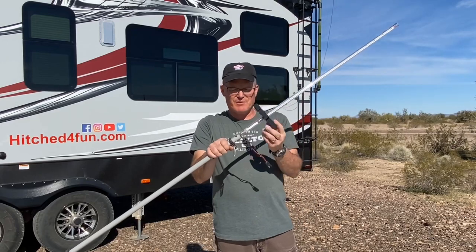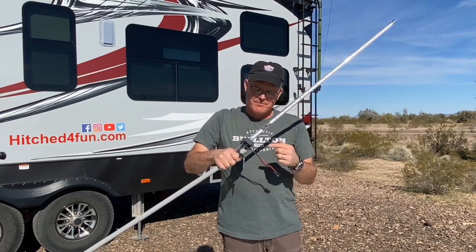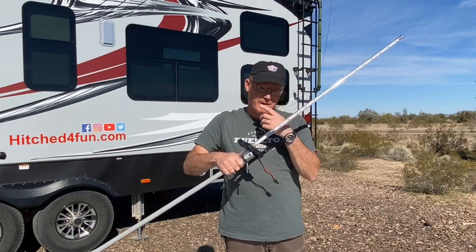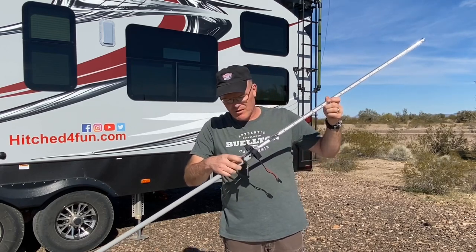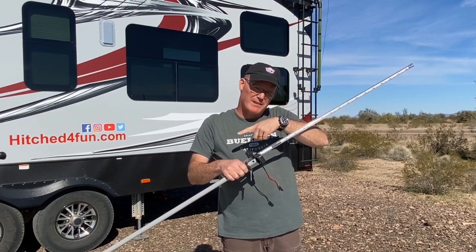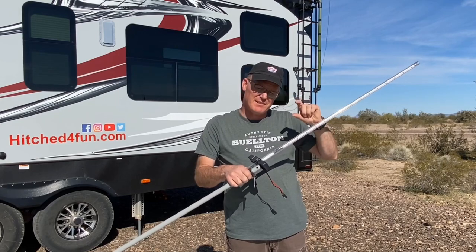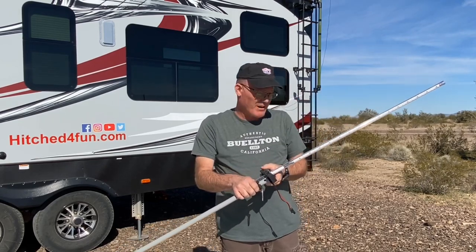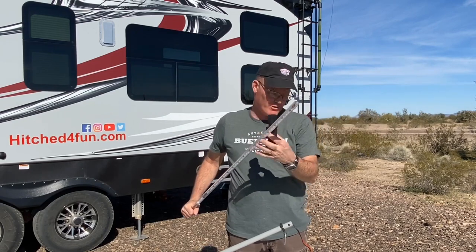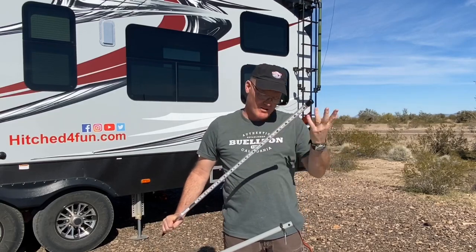This would be inserted in and this would go down and rest right there on top of the pole like so, if this were inside. Then you can connect your wires externally to this night light, which is really cool to help illuminate your USA flag or whatever flag you're flying on your pole. I'll show in a moment with a hole drilled into the side of the pole to allow the wire to go back inside, or you can run the wire on the outside using the pins that come with the pole to route the wire. So just personal preference — however you would like to do it. All you need to do is slide it right over the camp locator and put the cap back on after you've put it on or taken it off.